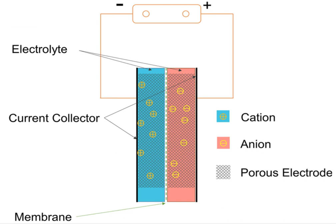In commercial double-layer capacitors, or, more specifically, EDLCs in which energy storage is predominantly achieved by double-layer capacitance, energy is stored by forming an electrical double layer of electrolyte ions on the surface of conductive electrodes. Since EDLCs are not limited by the electrochemical charge transfer kinetics of batteries, they can charge and discharge at a much higher rate, with lifetimes of more than 1 million cycles. The EDLC energy density is determined by operating voltage and the specific capacitance (farad per gram or farad per cc) of the electrolyte system. The specific capacitance is related to the specific surface area (SSA) accessible by the electrolyte, its interfacial double-layer capacitance, and the electrode material density.